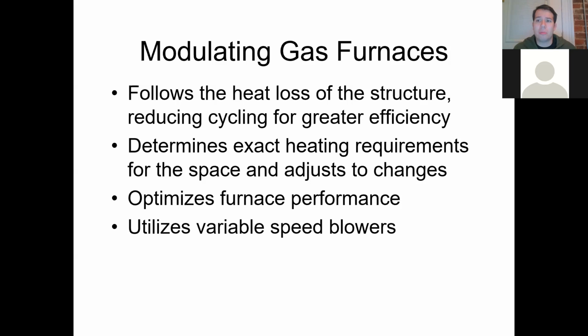And the last thing you want is a board that's under warranty, where you think it's wrong and you replace it. The system fires up for some reason, probably because it's a new board and it's got new power supplied to it, or because you tightened one wire down a little tighter than it was on the previous board, but you didn't notice. All the other board might have needed is a tightened wire. A lot of these boards, especially nowadays, specify inch pounds of force that each screw head must be torqued down to. And if it's not torqued to that, then it's void of warranty.